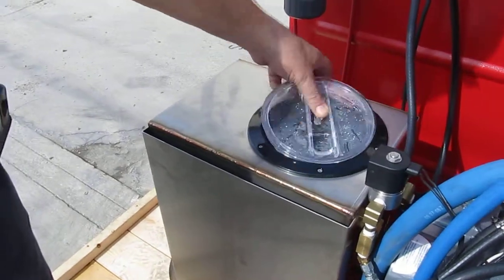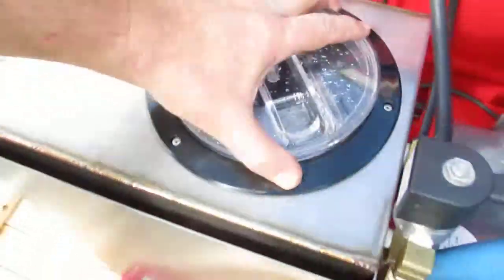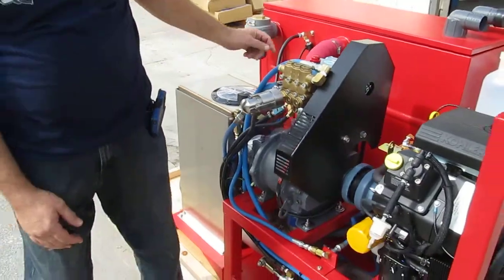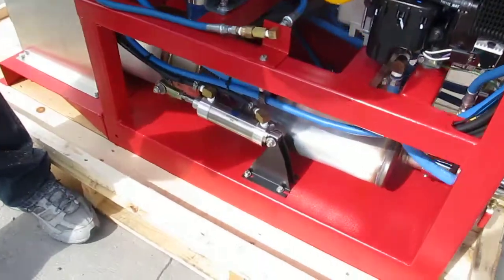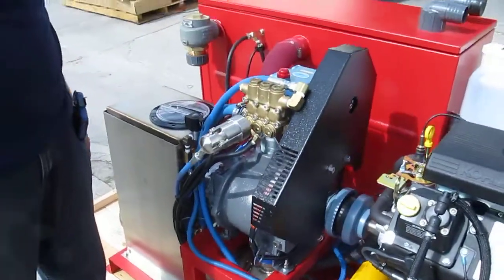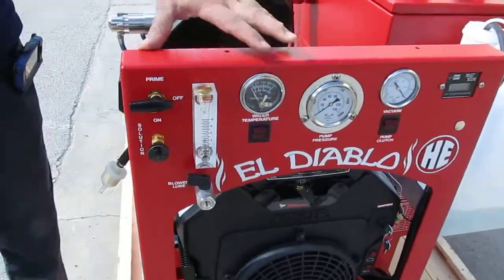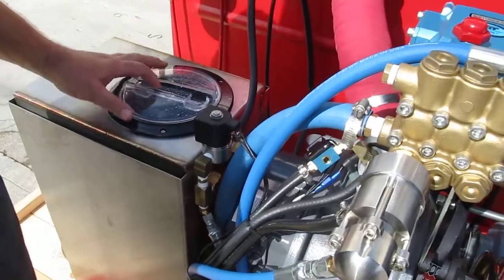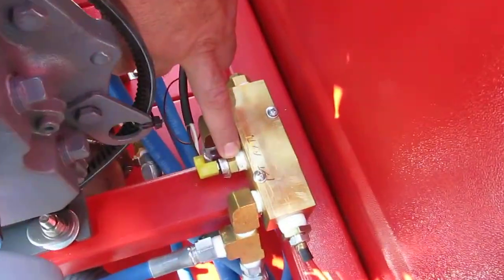This is your water mixing box, of course all stainless steel. You have a thermostatically controlled temperature that, via this vacuum control valve, is working this actuator piston and controlling, with exhaust diversion, your heat where you have it set. If it gets away from you and hits 235 on this gauge, it's going to open up this solenoid and start dumping. If that gauge fails, you have another preset high temperature emergency shutdown here that actually kills the engine.